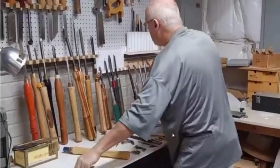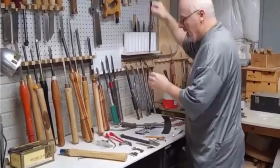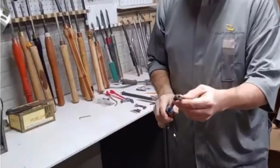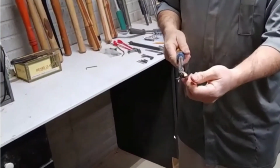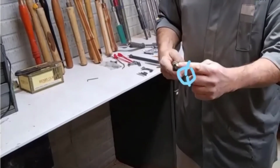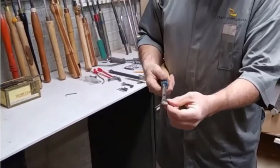And one other half inch diameter hollowing tool that I use, it's the Woodcut tool. Woodcut is an Australian or New Zealand company, I forgot. Anyways, it's a hook tool, and that brass piece on top is called a limiter. You adjust it such that only a tiny gap exists between the cutter, which is on the bottom, and the brass cap on the top. You create a tiny gap, like less than a 16th of an inch or so, and that controls the cut so you don't get catches. This is excellent for end grain hollowing, but I use it more for end grain boxes and end grain jars than I do for hollowing.